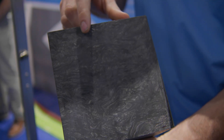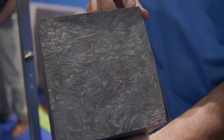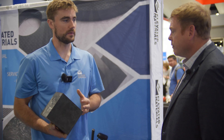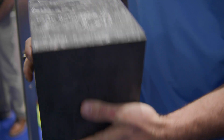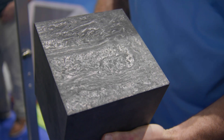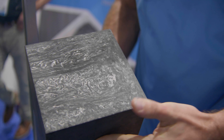We saw cut that down into different sizes that can be loaded onto a CNC mill and then cut into any type of part. These are uncured prepregged scraps that we collect and then compression mold into various parts.